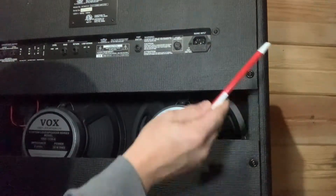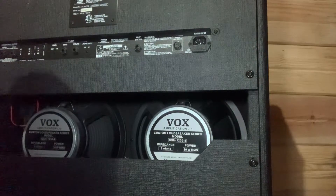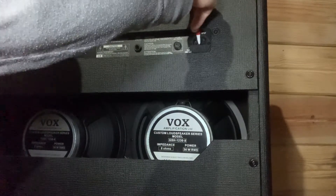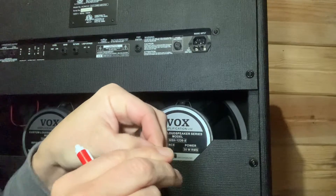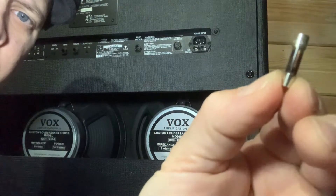So I'm going to take a peek at it and see if that fuse is still blown, then open up the back of the AC30. Right here under the plug, it's hard to see, but there's an area where a fuse pops out — this is the one that blew on me. I'll use a little pen to pull that out. You can probably see the darkness there — it is blown.